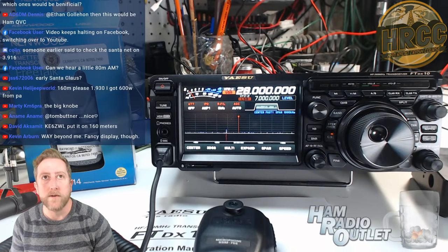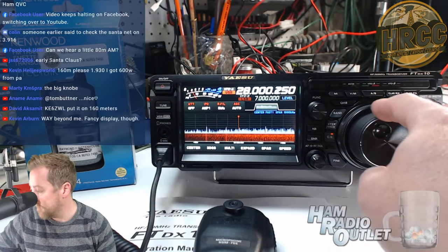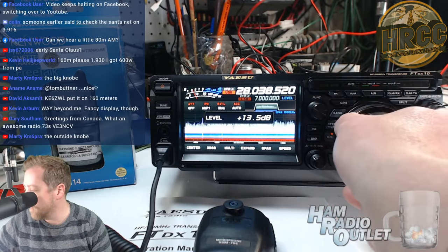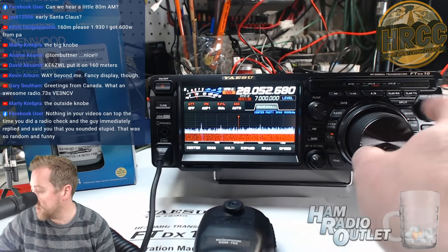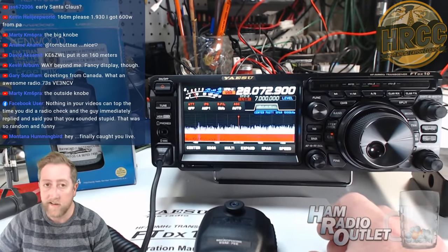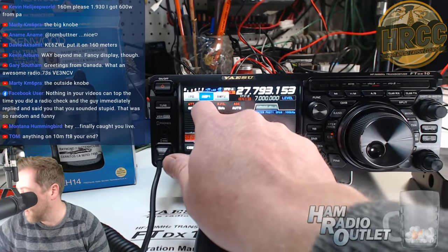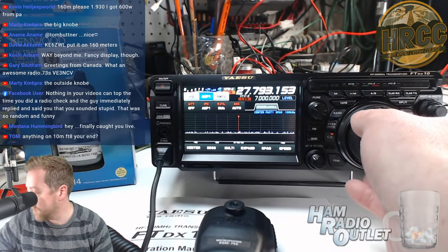Don, we'll go through the filtering, too. See what's going on, 10. There is an inner, I call it an inner VFO, and then there's an outer VFO. Oop, that's connected to the level. I don't want that. I had that set to frequency, and now I don't. Oh, that's why. Okay, when you have CS tune turned on, see, I'm learning too. It controls the level control for the SDR. See the SDR level? Let's knock it way down. Let's turn off the preamp for a second. Ooh, that's nothing. Back to the preamp.